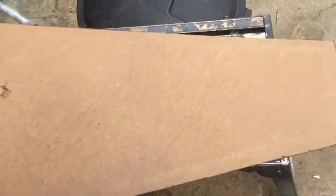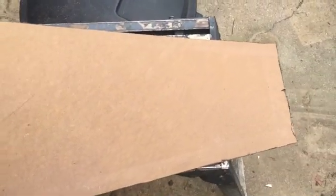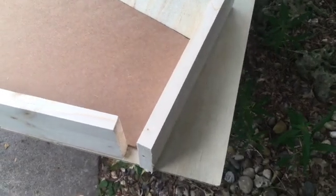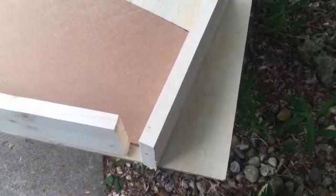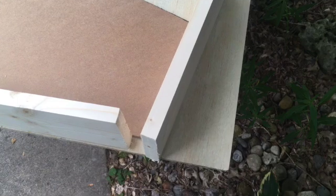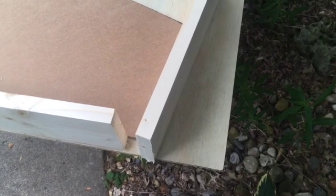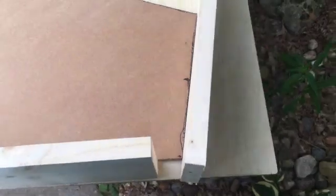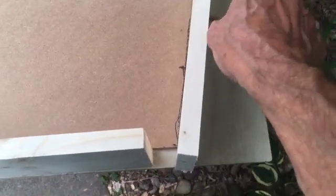The interior pattern is cut out. I've got to sand the edges and level them out a little bit, and then transfer it to the plywood. I'm going to create the outside border of the top and bottom pieces — or front and back, whatever you want to call it — by standing the one-by's up along the edge of the pattern that I already created, and then drawing the line on the outside of it.